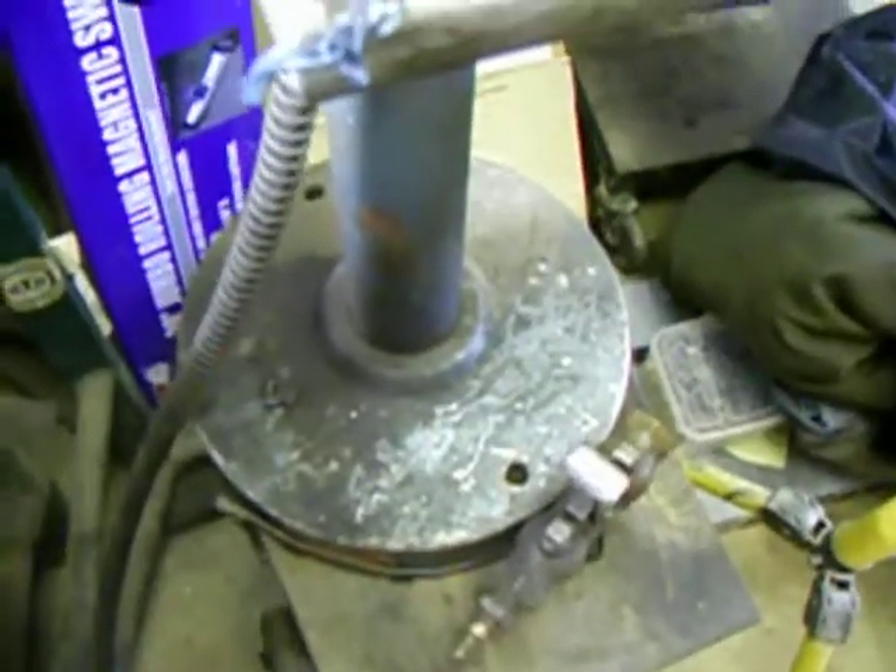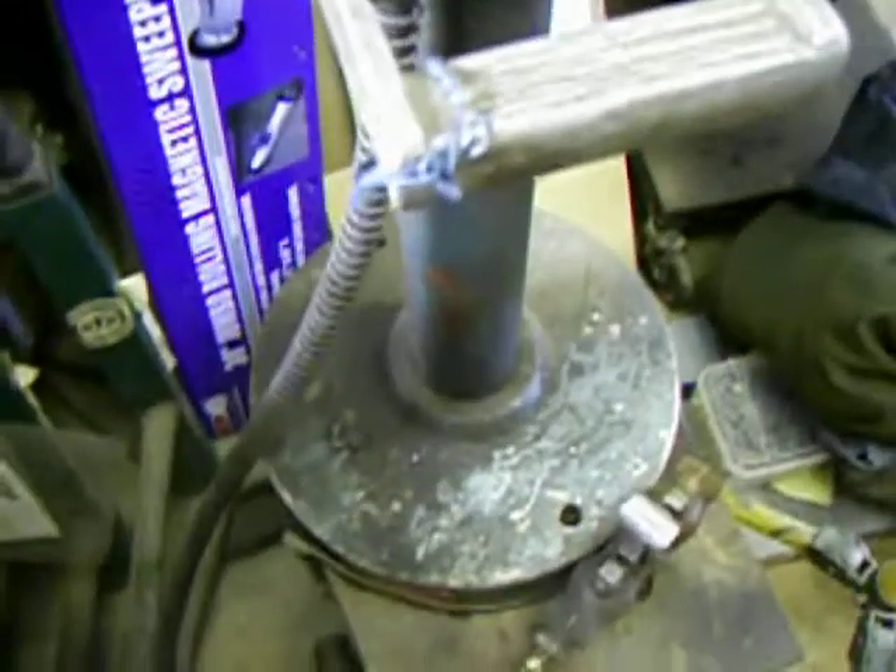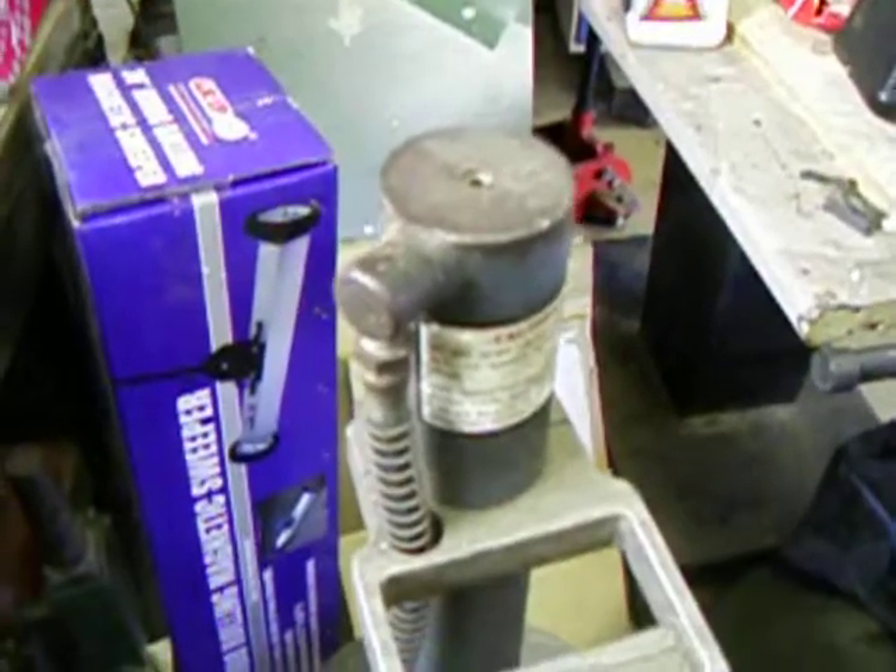So the difference in area is the multiplication factor of the air pressure compared to the hydraulic pressure. If I had 100 psi of air, this probably would have a 20 times multiplication factor on the hydraulic end, and probably jam out 2,000 psi — just rough numbers, but that gives you the idea.